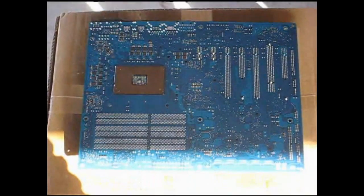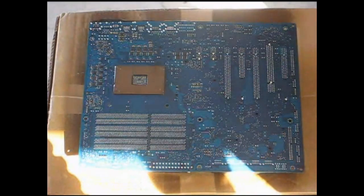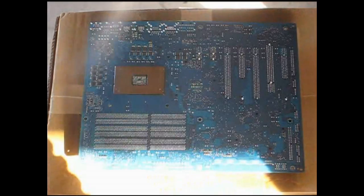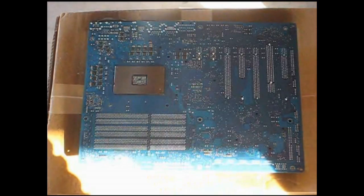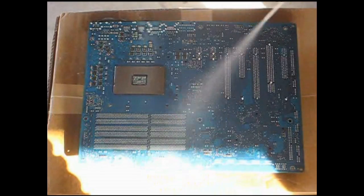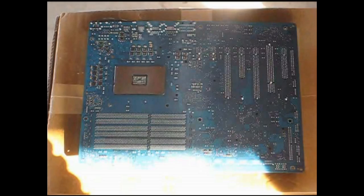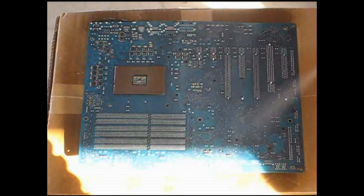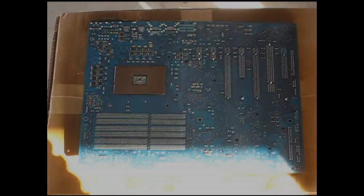Again, I prefer not to cover up the power circuits — I'll simply clean those off later with a cotton bud and the remover for this lacquer. Just a nice easy even coating spray on the back of the board, just so we can seal it all up, so any moisture build up will not actually cause a short. Very straightforward and easy, and a lot faster than using something like nail polish.